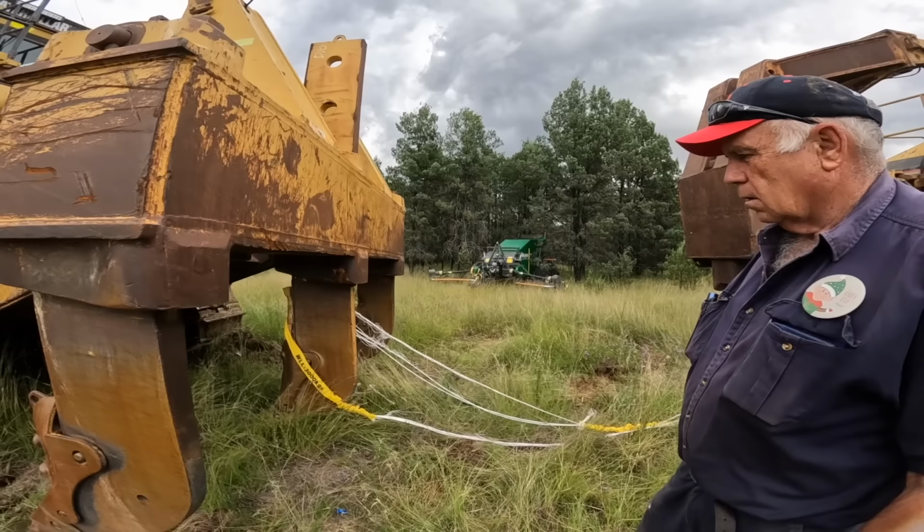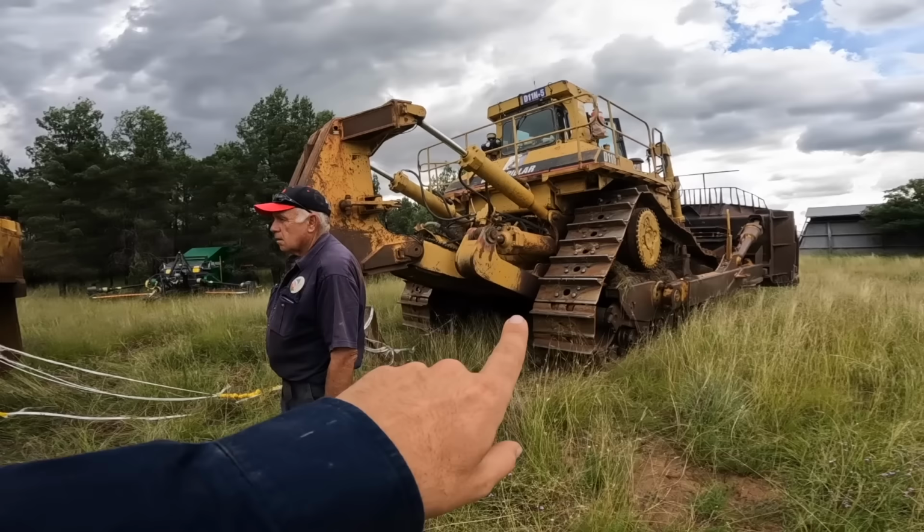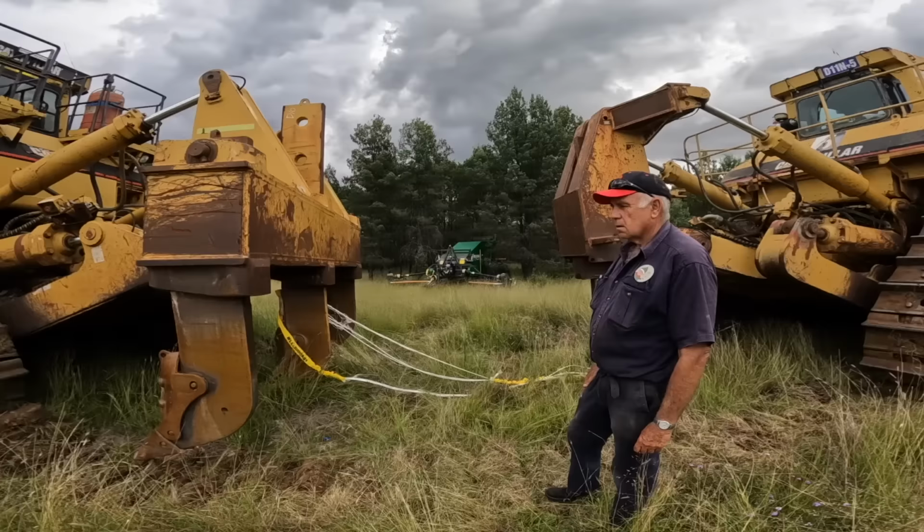I was surprised how easily it dragged this one tiny one backwards. We're actually on a bit of an incline, so that one's going slightly uphill, struggling against a little bit of gravity, not too much, but very interesting. To sum it all up, we reckon that these straps each have a breaking strain of probably closer to 30 ton, which is pretty impressive really, seeing as they're a 3-ton strap. So the safety factor is probably really 1 to 10. Quite amazing actually, and very handy for us to know.